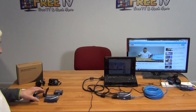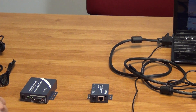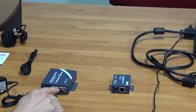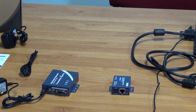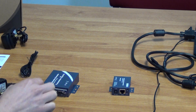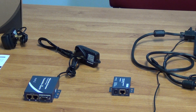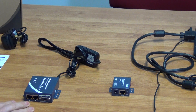I'm going to give an overview of exactly how this works, starting with the transmitter unit. We plug in the power unit here, then take the VGA lead provided and connect the source feed from our laptop directly in. You can also feed in the audio input here as well, so both signals are combined and ready to be fed out over the Cat5. There's also another audio output here for local outputs. If we had a local monitor we wanted to feed, we just run it directly out here. There are actually two outputs on the transmitter, so in theory you could feed to two remote locations.